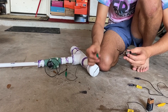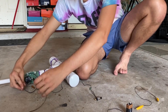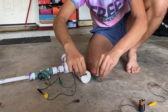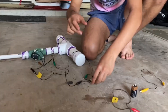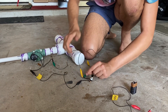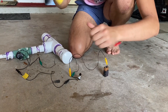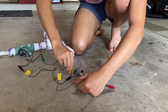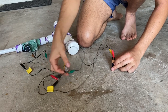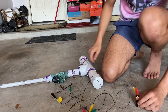To prove that this works: take your alligator clips, clip one lead to each of the sprinkler wires, connect the other side of each to your push button, and then from there connect each from the push button to your 9-volt battery. It doesn't matter which side. All of these are wired in series, and now your button will control your sprinkler valve just like you want.